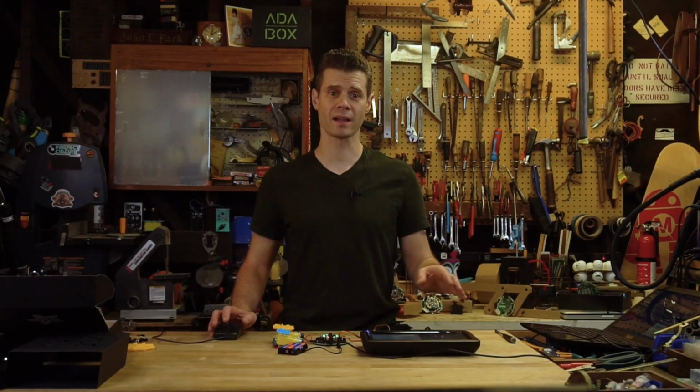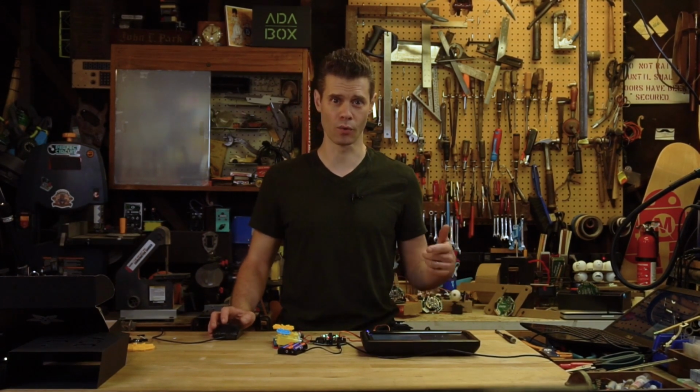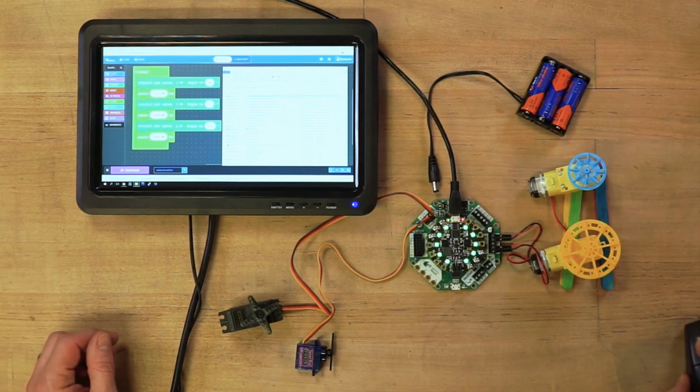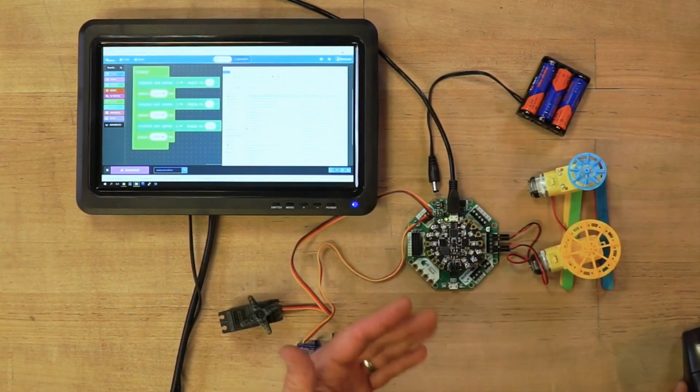And then I have the file I downloaded, which is the code that will tell the servo motor to go to 90, pause, 0, pause, 180, pause, and continue over and over again. So now we'll take the file that we downloaded and simply drag it onto the CPLAYBOOT. You'll see the red light flash on the Circuit Playground Express, meaning that it is receiving data.